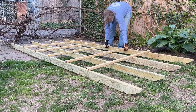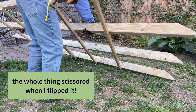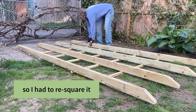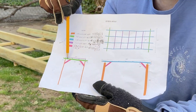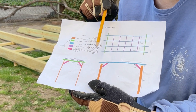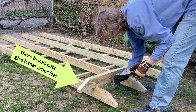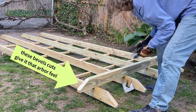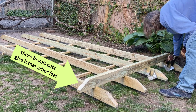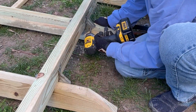I'm gonna flip it over and hold the cross pieces at the end. Now I'm gonna position these green cross pieces on the ends — they are attached to these long two-by-fours with brackets. This is the hardware I salvaged from the old arbor. These are hurricane ties. The diamond-shaped ones I'm gonna use to tie the shorter cross piece to the longer ones.